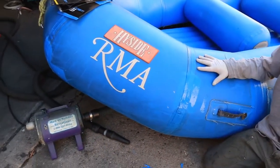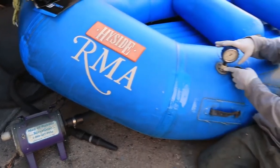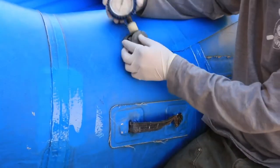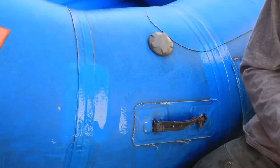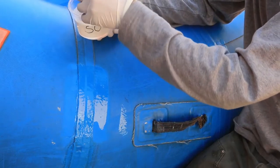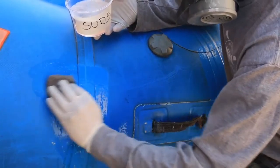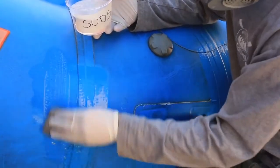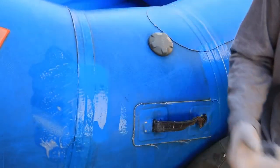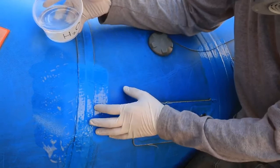Step 2: Inflate the boat. Do not inflate to full working pressure — about 1.5 psi is ideal. You can use an inflatable pressure gauge to be exact. Step 3: Using a steel wool pad, scrub the area to be coated with soapy water. Rinse completely with clear water to rid the area of any detergent residue. MEK or isopropyl alcohol can also be used to further ensure that the area is residually clean. Please note that MEK will stain PVC, so it must be used sparingly with the utmost precaution.